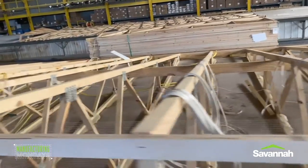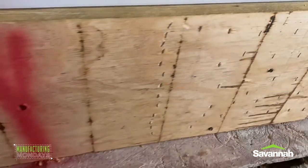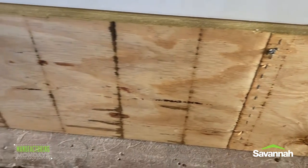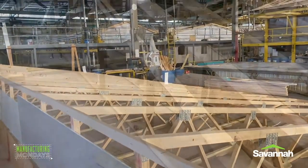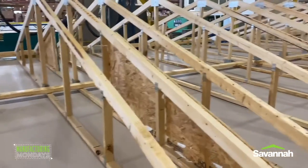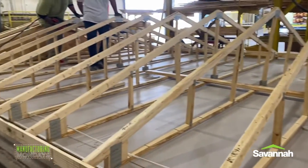They transmit the weight of the structure plus the roof load through to the foundation beneath. The weight this 2x12 column is designed to hold could be three times or more the weight found under the I-beam. The length of the ridge beam determines how much load each one of these built-in supports has to carry. If you have 10,000 to 18,000 pounds of weight within a home that is unsupported, you're eventually going to have a problem because gravity always wins. Hence the need for our 2x12 laminated ridge beam located at each of our spans on all marriage lines.